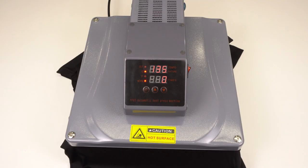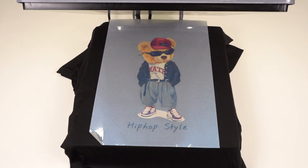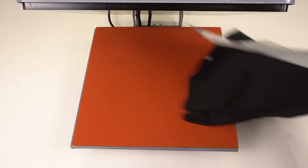The second influence element of heat press result is the cooling method. If you blow some wind to cool down the film or put the film under the air conditioner, the cooling is not slow and stable. As a result, the coating adhered on the pattern is not even, so the appearance is poor.